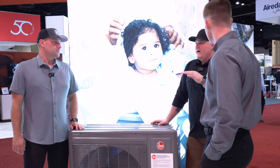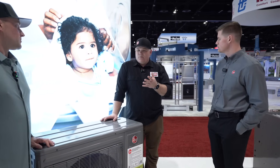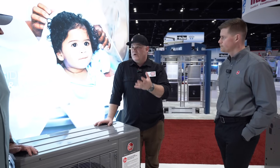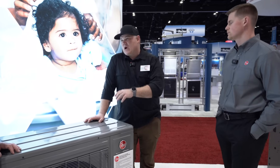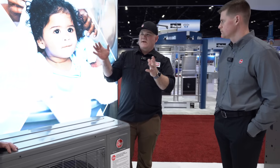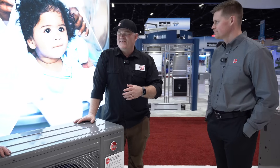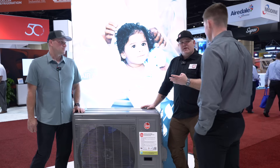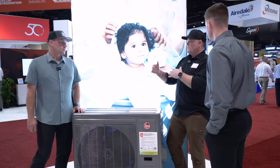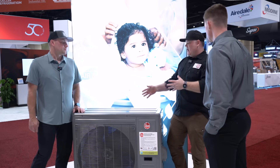I'm thinking we go to our customer's house — maybe it's the first time we've been there, maybe you were there two years ago and put a new furnace in for them and they couldn't do the AC at the time. Now you could drop in with a side discharge, lower your footprint, get this in a nicer spot outside — maybe away from a window — and then connect it to an existing system. So maybe it isn't even your equipment, but that retrofit is going to be moving our customer from a unitary AC split system into a heat pump. You could go do dual fuel.